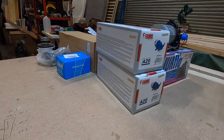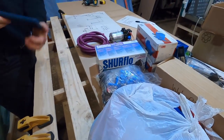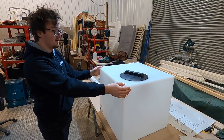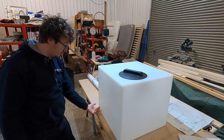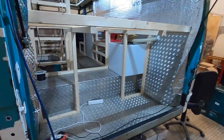We're going to split our plumbing into two videos. This first video is going to be all about our cold water system. Next week is going to be our hot water system and maybe some of the waste, depending how quickly we work. The heart of our water system is these two 140-liter water tanks - they are 550mm by 550mm by 500mm high - and they come with a three-quarter-inch BSP outlet plastic-welded in ready to go.